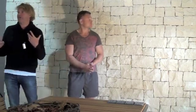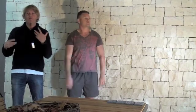Look, it's white, so if I was going to put this outside and I was concerned about some oxidisation, and when we talk about oxidisation, we talk about pollution or mould occurring on a stone, sometimes with sandstone, particularly in Perth, your WA limestone goes very black because it's a very soft, porous stone. This material is not like a WA limestone, so it won't perform like that. It will retain its characteristics a lot better, but it is white.